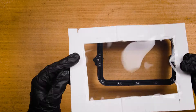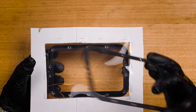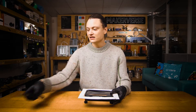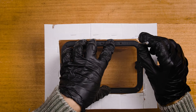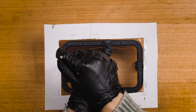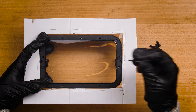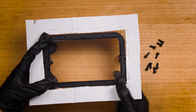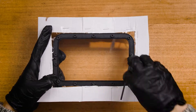Now overlay the FEP and the cardboard over the top of the tank. Once lined up and happy, take that metal spacer and put it on top, pressing down lightly. Then take something pointy like the top of the scissors and poke little holes through the FEP at every single bolt hole. Bring the bolts back and push one through a hole, lightly screwing it in about a third of the way. Do the same with the opposite side, then continue adding bolts at opposite sides, tightening them all down bit by bit in sequence.